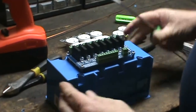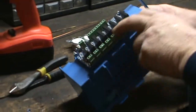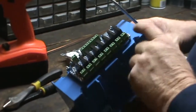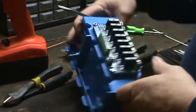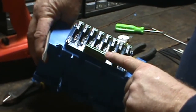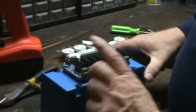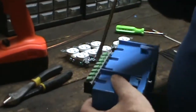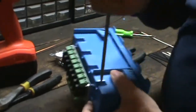Relays are on there now. On the box itself, on the side that has the eight long connectors - those are the 110 connectors. Over on the other side are the five-volt connectors coming from the Arduino, and the power goes down at the last one. On the side with the 110 connectors we're going to open up the knock-out holes in this box - just pry them open.